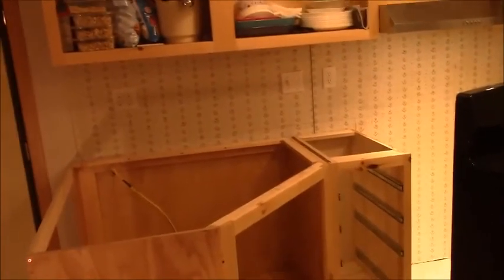So we've got the sink corner cabinet in place. We lined up this one. You saw that one before, but it wasn't screwed. I traced lines on both sides of it. Went in slightly less than 3/4 of an inch, the width of the plywood. Screwed blocks to the floor. And now we're going to set it over the top. And hopefully it'll all line up. And then we'll just put screws through the toe kick and the back side. And it'll be anchored there forever.